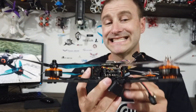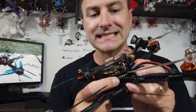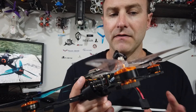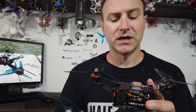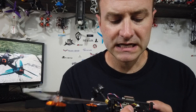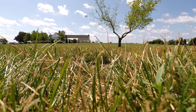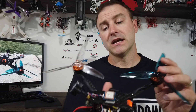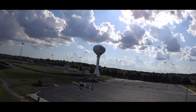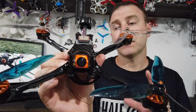There are a couple little things I just didn't know, so I had to redo some steps. The only soldering involved is the motors to the ESCs and the XT60 connector on the back — everything else is plug and play. You can see the connectors here for GPS, VTX, camera, and antennas just screw on. It's a pretty simple build, and if you're looking for something for a first-time build, this is a good one. Setting it up in Betaflight was pretty much a snap.